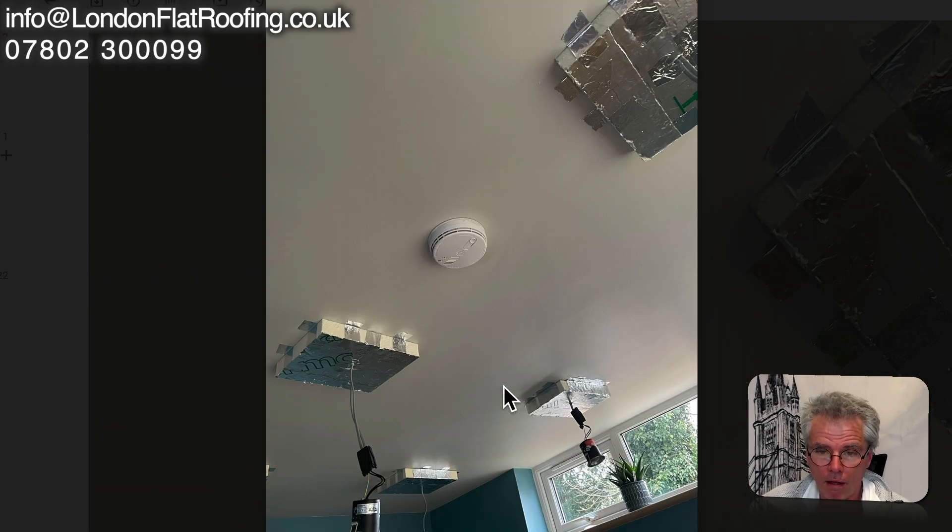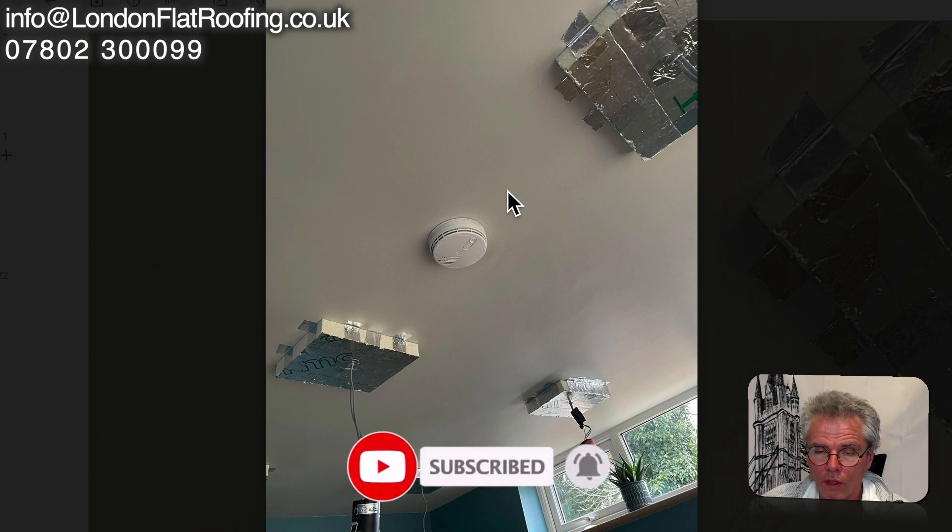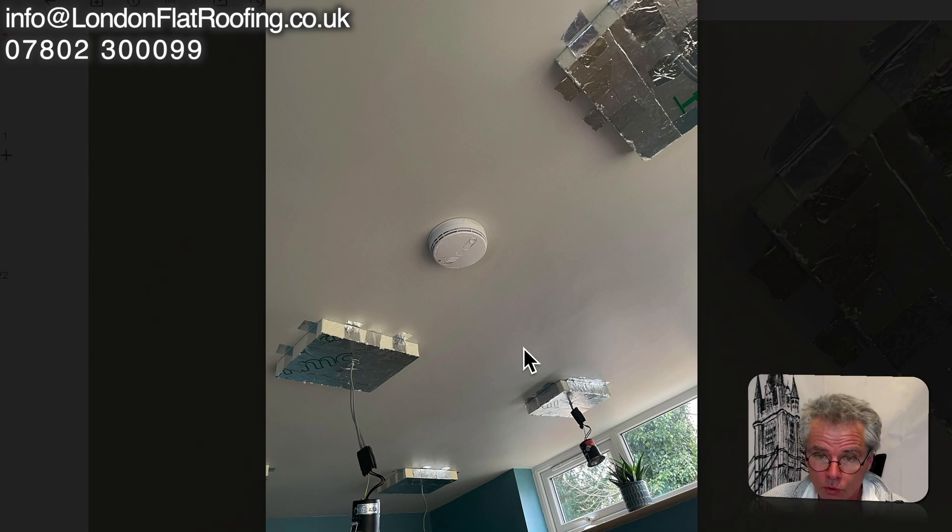Personally, I wouldn't take the whole ceiling down. In the past I've taken lights out, fixed the plasterboard and insulation, then decorated over the top — using light from different angles, placing lights in different areas, and with some filling, you can disguise it beautifully. This ceiling looks fantastic, the plastering is excellent, and with a little effort the big holes could be cut to get the insulation in without removing all the plasterboard. Since he's already increased the outside ventilation and the insulation is going back in, I don't think there's any need to install a vapor barrier. That's what I would go for.